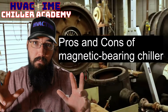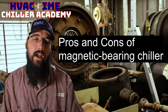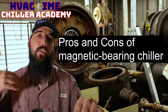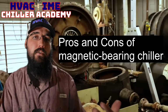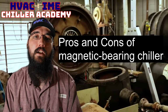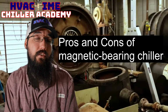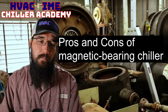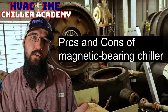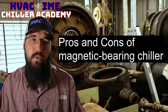Now, some of the more modern ones, I guess they're all modern, some of the newest ones will have oil catches right in the suction cone, so that if there is any oil in the system, it has a way of getting caught as it's coming into the compressor and draining down into a little trap reservoir. But these are small reservoirs, if they even have one. They're just trying to help solve for what comes back to the technicians' lack of practice and understanding.